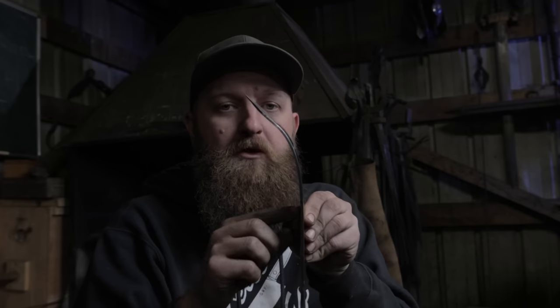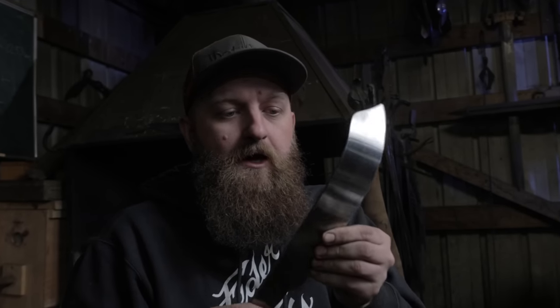I wasn't really worried about the bend test. However, I had never done it, so of course I was a little stressed out about it. I'm gonna make a few changes on my actual Journeyman test performance knife, and that is I'm gonna add a little less taper to the blade so I get my bend more in the middle, less on the end. But overall, it cut well, the edge didn't deform, the heat treat was pretty well. I don't know if I'm going to use that exact style heat treat or not, but nonetheless, we have success.